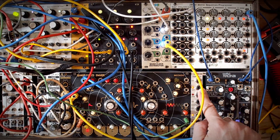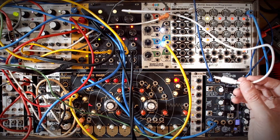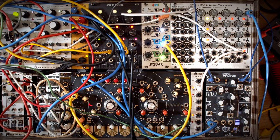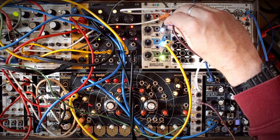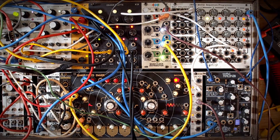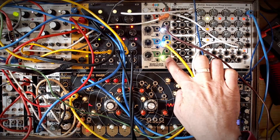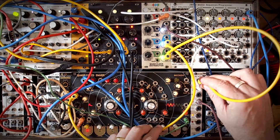What I'm going to do is disconnect the clock that runs the sequence. The funny thing about voltage control switches is these are inputs or outputs depending on how I patch them. What I want to do is patch this so that one of the inputs goes to an output. If I connect this, now we've got our patch back as we had it before. But now that we have the switch, we can interrupt it — with this slow voltage coming from here, which is just on and off. Perfect for this purpose. Into the CV.